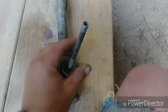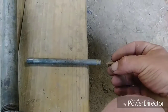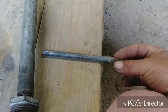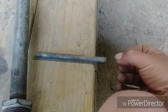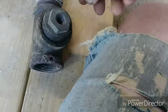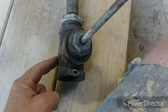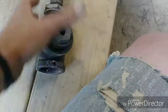Before that goes in — and it'll get soldered in — we have a 035 MIG tip. I'll boost this up to a 045 if I have to, or even go to a 1/16 — shove the pipe down through there, cap it off. It's a little bit loose, so I'll take it to the grinder and taper that down until it fits snugly, then solder that in. Then I'll stick it in here and solder that in. This is where your air supply will come in, so we should start mixing right here when the gas is coming straight down and the air is coming straight in.